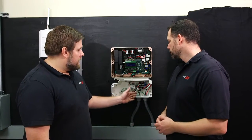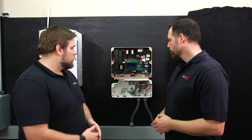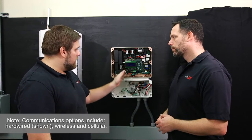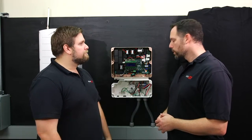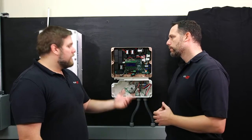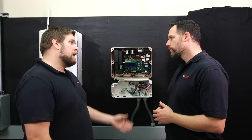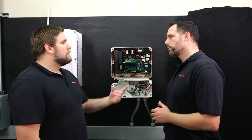Now that we've finished our DC connections and AC connections, it's time to set up the data cable for this inverter. We're going to run the CAT 5 cable through the DC safety switch into the inverter. Plug one end of the CAT 5 cable here and the other end in the homeowner's router or switch. You have a maximum distance of 330 feet. If you use the cable gland provided, it works great, but if you decide not to use the cable gland and run conduit, you get a more aesthetic, cleaner installation overall.